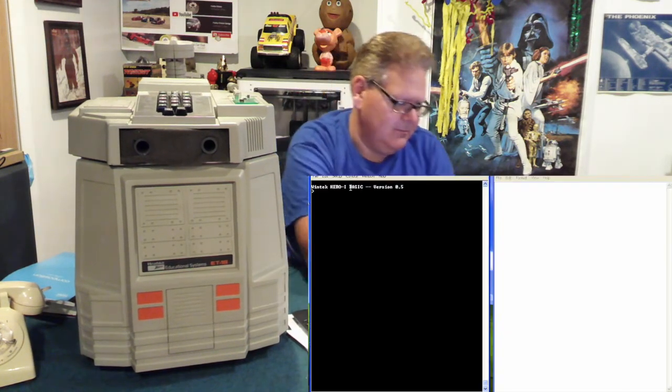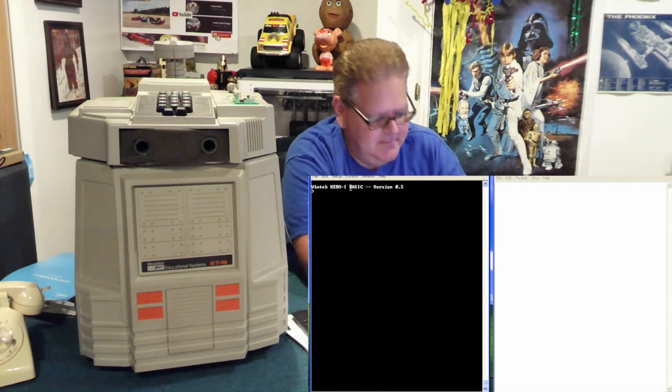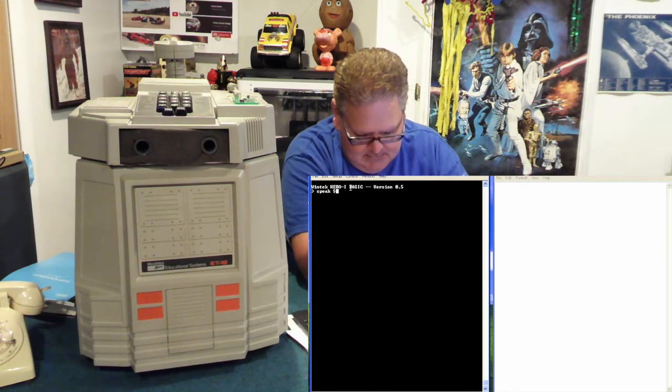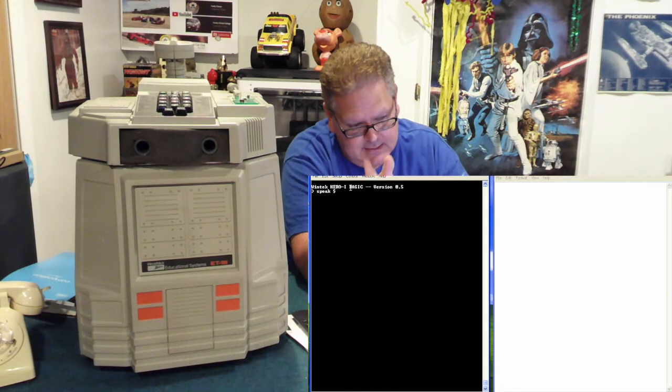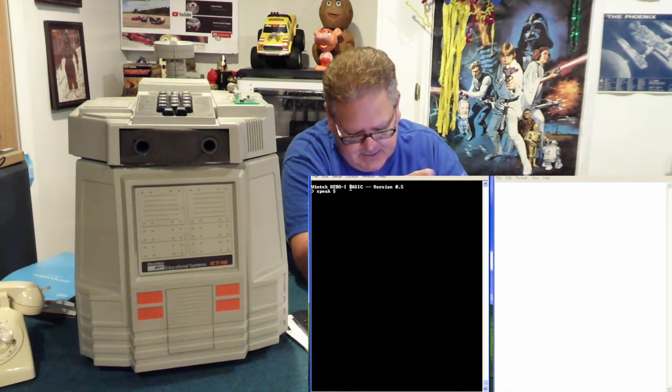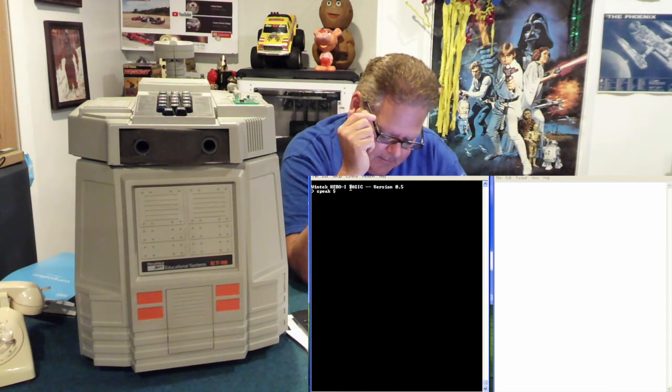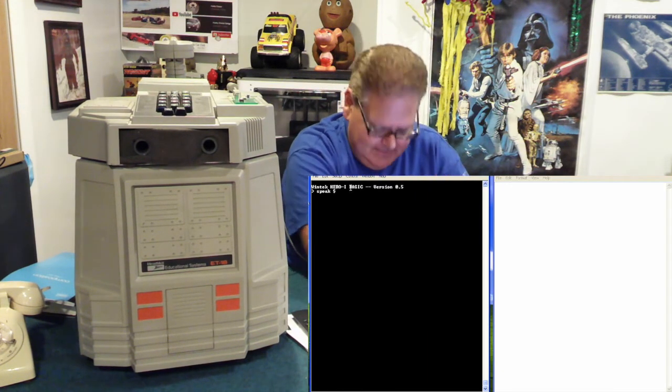And according to the voice dictionary, for him to say that, we need the address FA4B, and then he'll say that. So we go to the screen here. We'll type a command called speak, S-P-E-A-K, and then I'm going to put a dollar sign there. I'm not sure what that's exactly. I think it's telling it to call up from its memory. Don't quote me on that, but I know you've got to have it there.